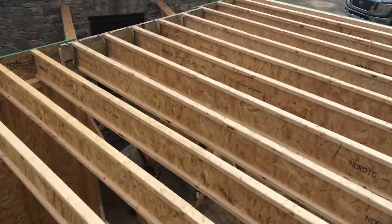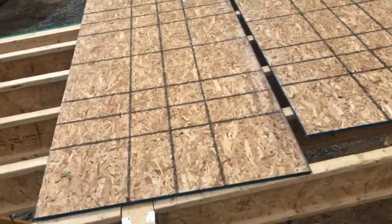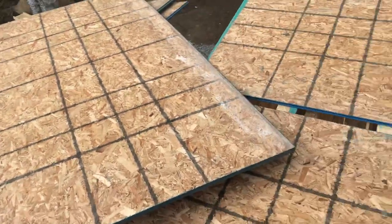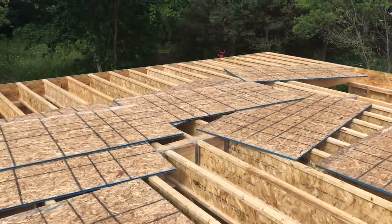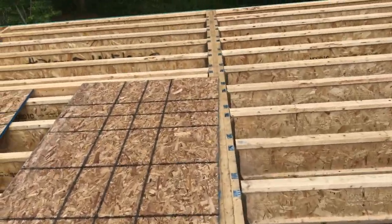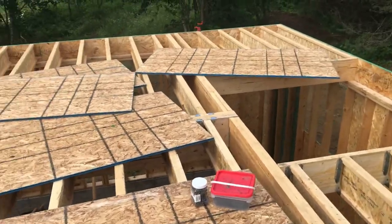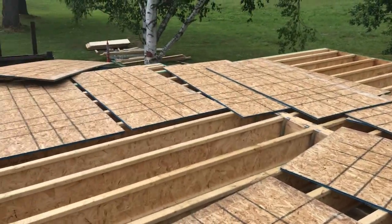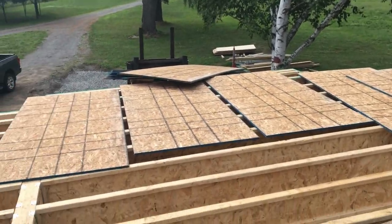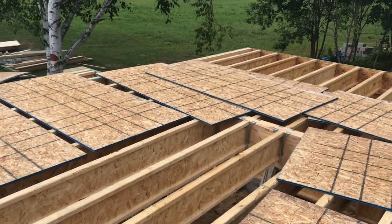With Jillian's help, it only took two days to get all the floor joists and beams installed. Now it's time to put in the subfloor. You can see I was able to put a pallet on the tractor and lift it up, which was pretty handy. There you can see the second beam I was speaking about earlier, and right there we have a staircase opening that we'll explain in a future episode. This is a three-quarter tongue and groove OSB subfloor — it's going to get glued and screwed to the floor joists.